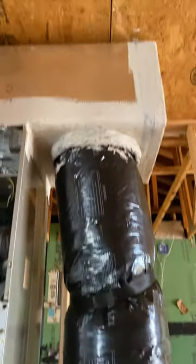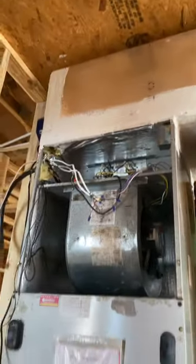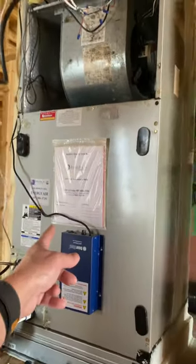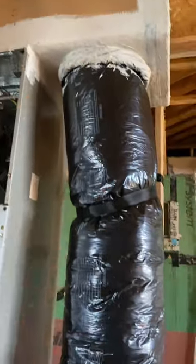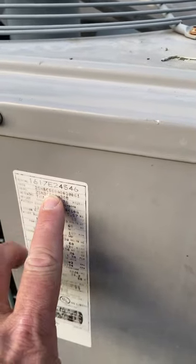Are you stupid? There's a 12-inch flex R6 duct here. Let's take this 5-ton unit and make a piece of plenum out of duct board that feeds this 12-inch flex — 60,000 BTUs.